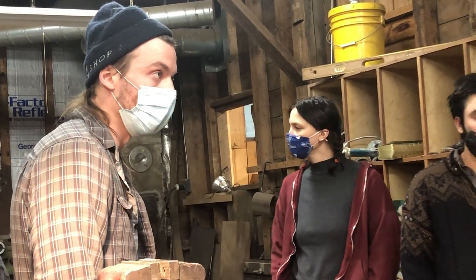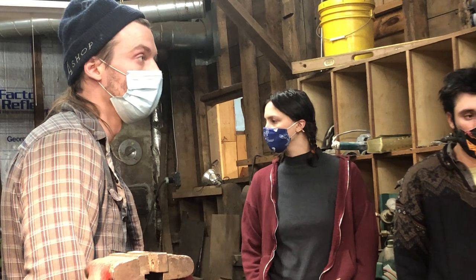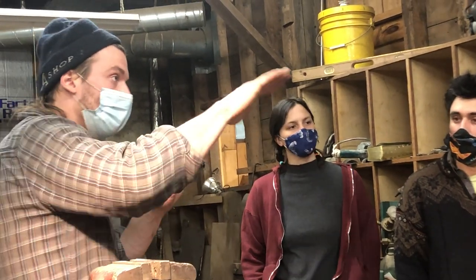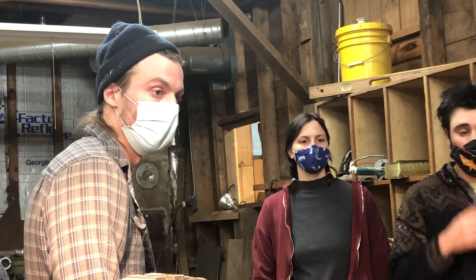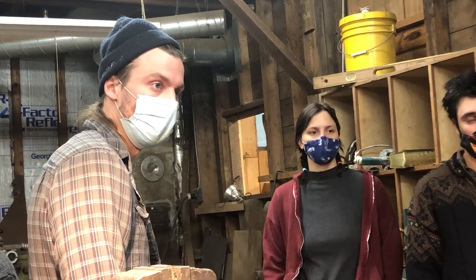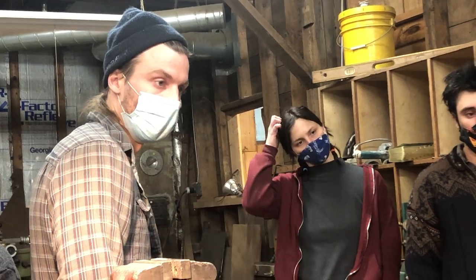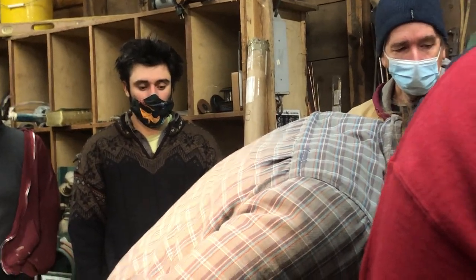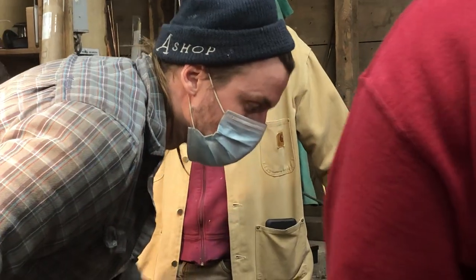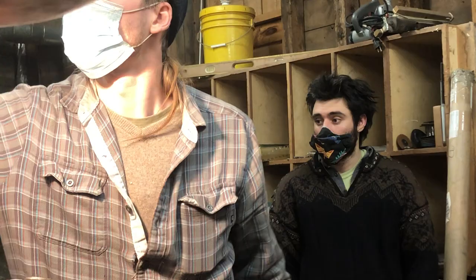So the temper is what's gone. Is the thing to do to try to re-temper it? No, because that's just gone right on the very edge. Oh, okay. So you can just sharpen it just to get rid of that. Okay. And then you'll be back down to a good steel, and you don't have to worry about it. Otherwise, this one's tempered, and so that's not good, but this one is otherwise okay? This one, look at this, the very corners. See how they're kind of folded over, and you can see where the temper's gone, and they're worn on the corners. So if you feel it, it's not sharp at all.